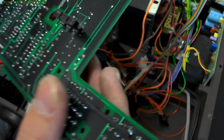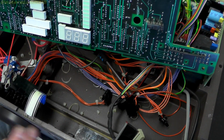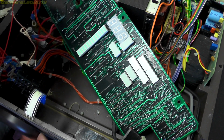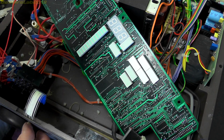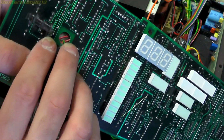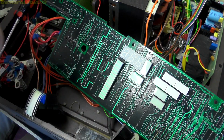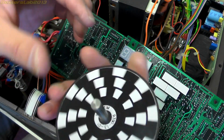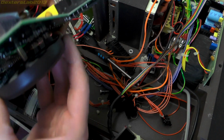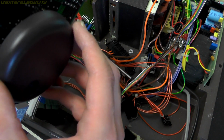We've got some optical things. Oh, I see. Oh, that's clever. The rotary dial on the front here, you can just see it here in the corner. It's just a freewheeling wheel and there's 3 sensors just here. Yeah. So the wheel is encoded with the patterns there onto optical sensors. That's quite a neat solution, that.